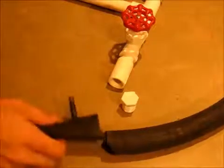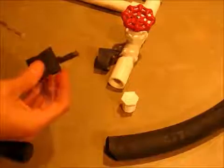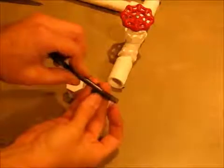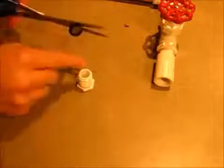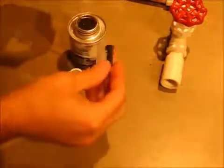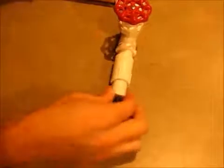On the air side, if you're using a bicycle pump, take the bicycle tire and cut out the valve. Next, drill a hole right in the top of the cap, right in the center — about a five-sixteenths size so the valve will fit through. Trim the valve down just small enough to fit in there, dab a little glue on it, and stick it through. Once it's dry, Teflon tape it and screw it in.